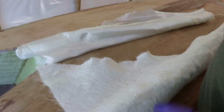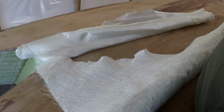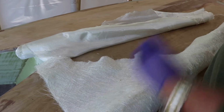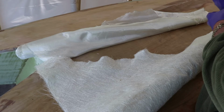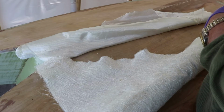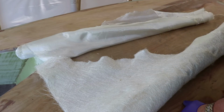That's why you'll see polyester resin considerably cheaper compared to epoxy resin, but it has a much shorter shelf life. If you're doing a boat and you're ready to go... I've been building this for almost a year. I think the shelf life of polyester resin is like 2 or 3 months. Somebody can correct me if I'm wrong. And once you crack it open, or even from the manufacturing process, it has to be used in a certain amount of time.